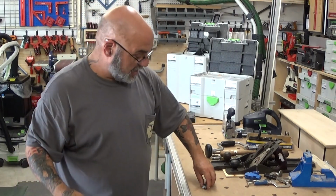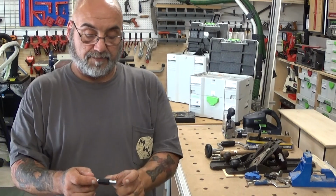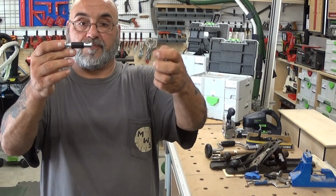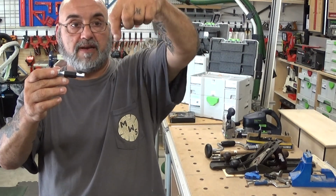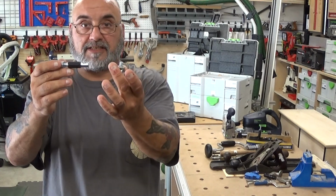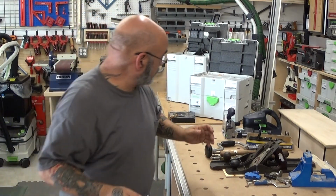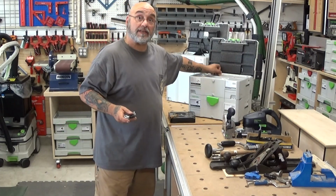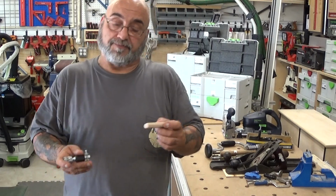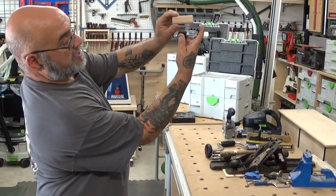Now, you take this locking bracket, you drill another 14 millimeter into the other side, and then you drill a 14 millimeter by 50 millimeter deep hole down straight. You drop this in, and then you put the two pieces together. Now, you're also going to drill, or mortise, another 14 millimeter so that you could use a regular domino, so that they will line up like this.